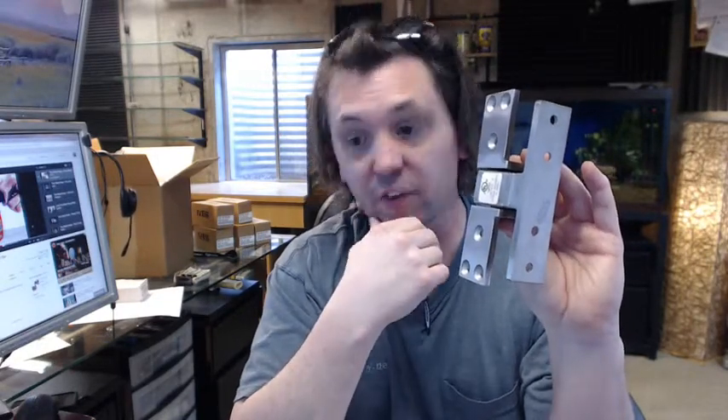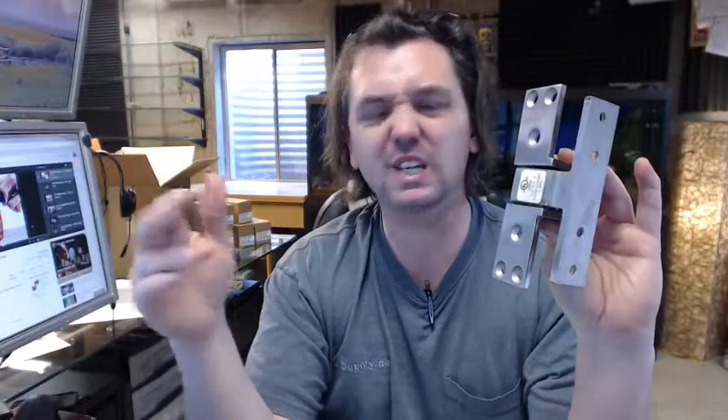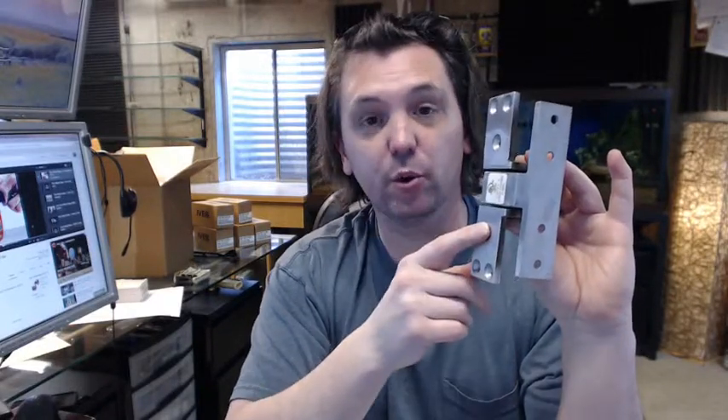These hinges are capable of handling very heavy doors, which is generally the case with the steel doors you will see in a hospital — those doors have a lot of hardware on them and are generally very wide: 3'6", 3'8", or 4 feet, and generally at least 7 feet tall. Ives does recommend up to 7-foot doors to get away with two hinges, but I have always seen them installed in sets of 3.